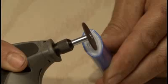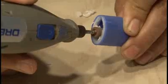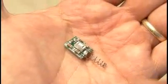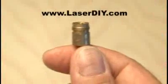Now it's time to completely gut the inside of this lighter, and I used a Dremel to cut open the bottom cover. Then I used a little sanding wheel attachment to finish it up. I also drilled out the 2 existing holes to make them a little larger for the components we're going to put inside. And those components are a small driver extracted from a blue laser pointer and also a blue laser diode in a small mini module.